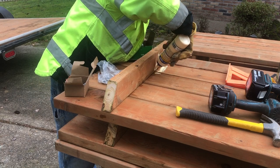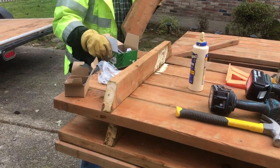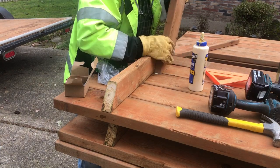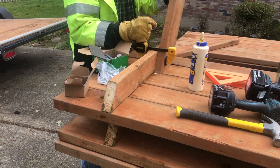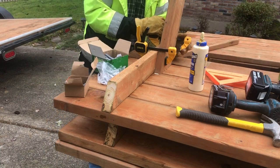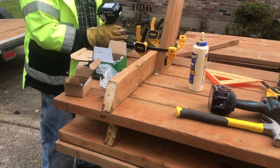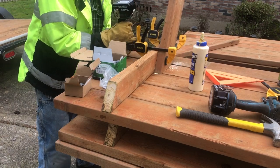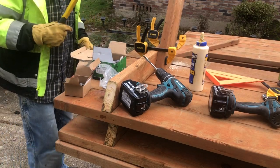The legs go from the edge of the second tabletop board — the outside edge of that board lines up with the outside edge of the leg. As I put this up here, I line up the outside edge; the inside edge overhangs onto the next board. The edge of the second board and the leg are lined up. We'll put a couple of quick clamps on there to hold it, then take a 3/8" drill and drill through to pilot the hole for the carriage bolts.